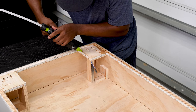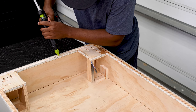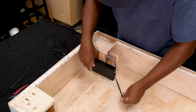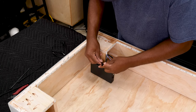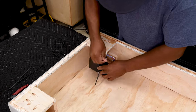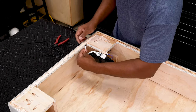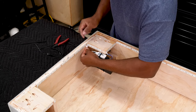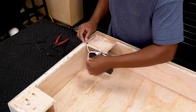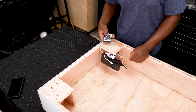With the LED strip connected directly to raw wood, over time it's likely it would detach on its own, but one way around that is to run a small bead of hot glue alongside the strip — I've had good luck with this approach in the past. I'm going to take a battery pack that puts out 12 volts, which is enough to power the controller that will then control the lights. This controller can be controlled by WiFi or the remote. I need to position the infrared receiver so I can hit it with the remote. This worked as expected, so all I need to do now is reinstall the base.